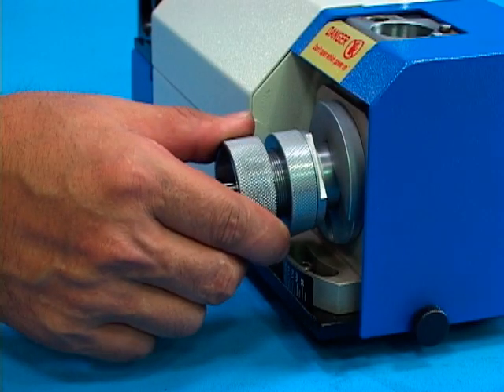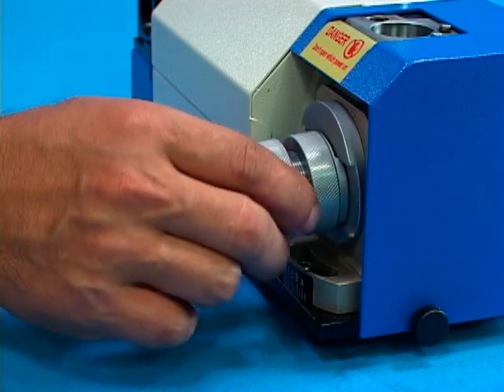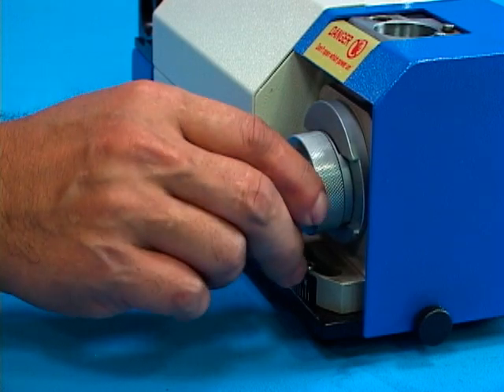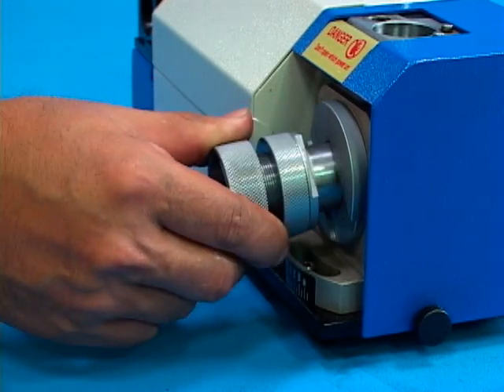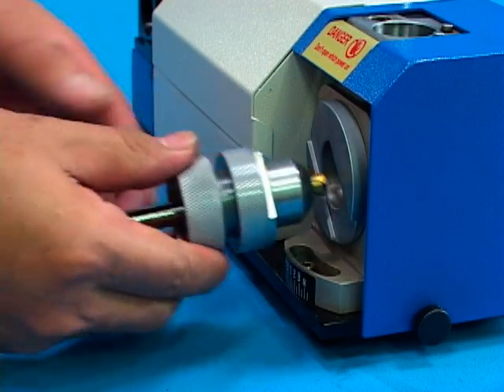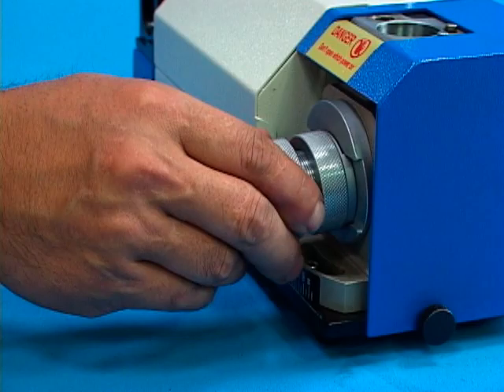Have the drill slightly touch the grinding wheel. Perform slow feed for pressing it to the bottom. Then turn counterclockwise and clockwise revolves until grinding sound disappears. Take out the ER collet chuck, rotate it 180 degrees, and repeat above procedures for repetitive grinding to finish the drill edge grinding.